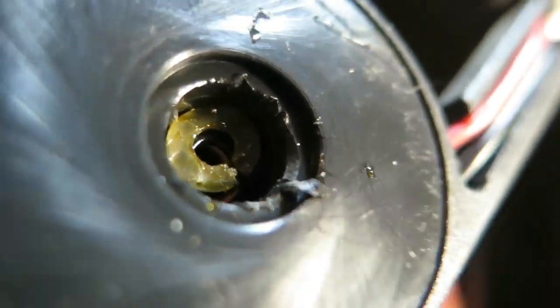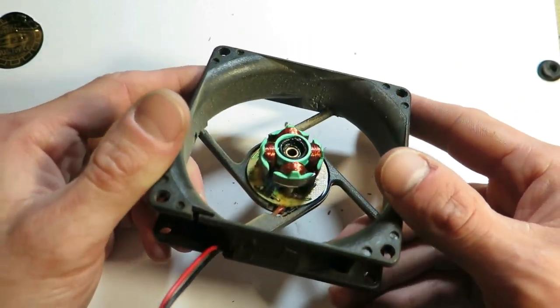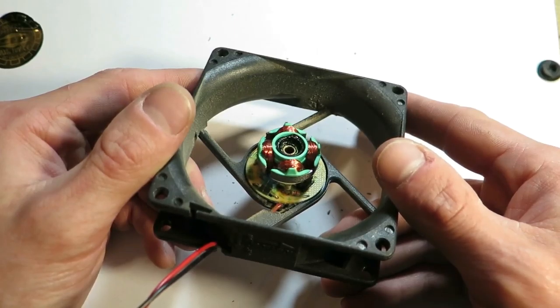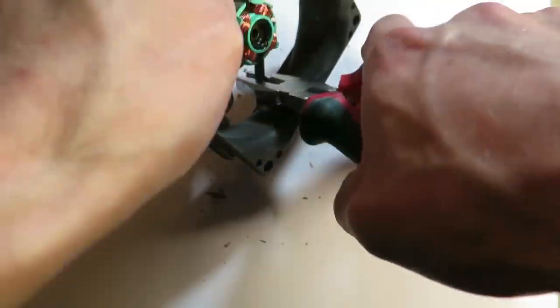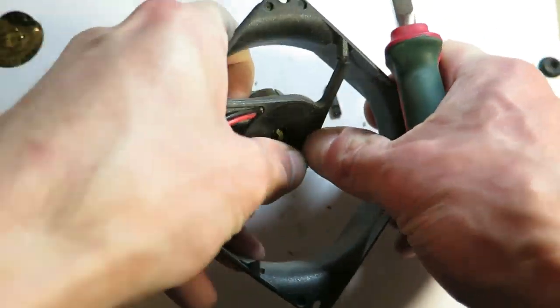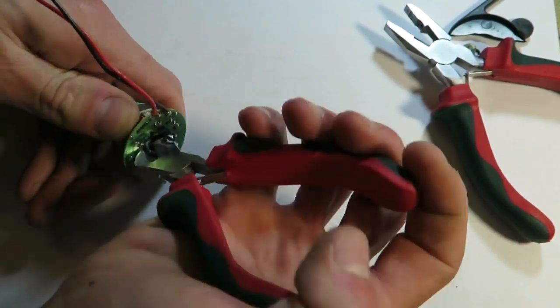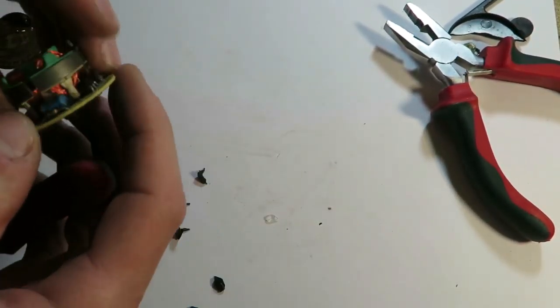Fans with two wires are better because those with yellow wire usually have a failsafe feature that if you have low RPM for more than 2 seconds, it will stop for 2 seconds or so. Best Hall sensor is with two outputs, however these are most common. If you get sensor with one output, you will have to negate it. Outputs of these sensors are most commonly open collector.